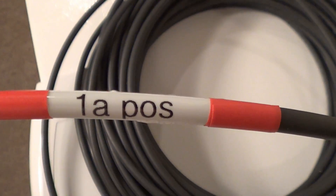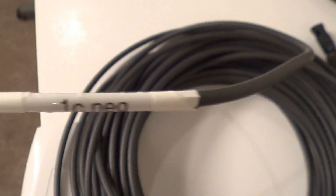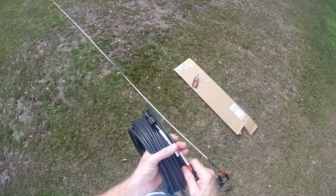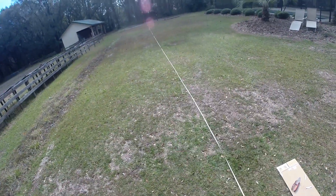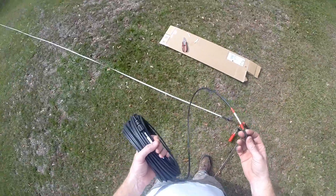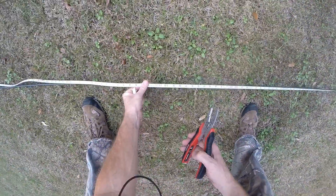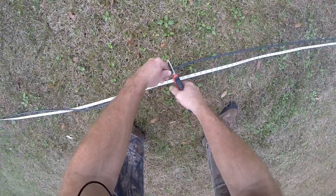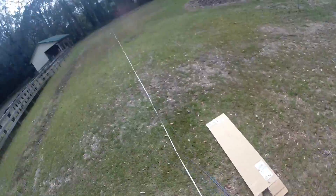This is the first row, Bank A. This is the positive lead — I'm putting the red tape on here and the white tape on the negative. So now I've got to lay out my PV cable. I've got a measuring tape across the yard here, I'm going to roll these out and cut them to length — there's 56, that'll be the 44 cables here.